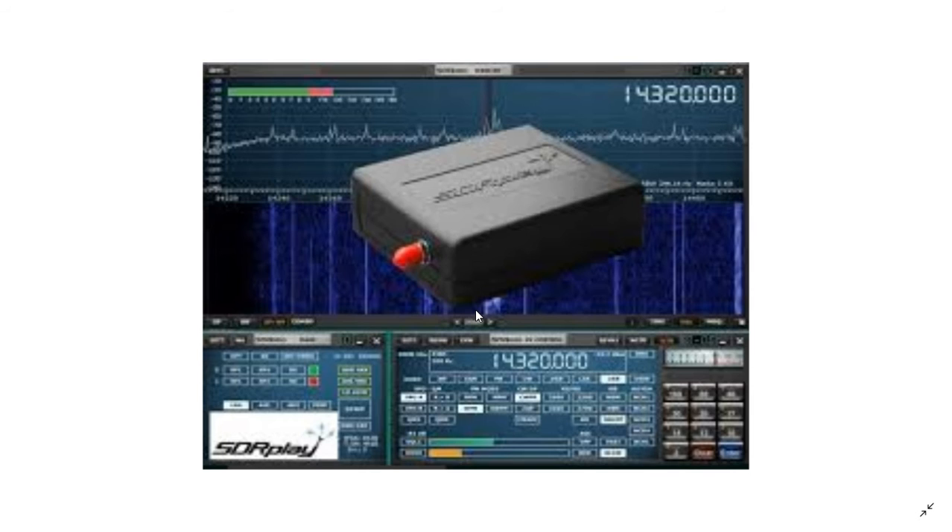To get it back, I had to toggle the mediumwave filter on and off. It seems that at some point there's a kind of breakthrough overload. You've got to play with the RF gain a lot because it does overload, and when it does, it becomes deaf on the mediumwave band. So you've got to really tweak it carefully for it to work well. But when it works, it actually works very well on mediumwave — you've just got to play around and tweak to make sure it doesn't overload too much on that band.